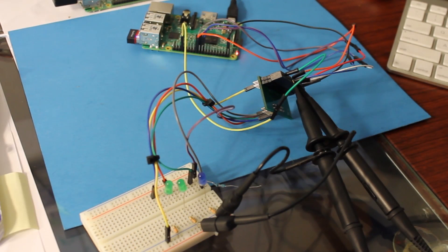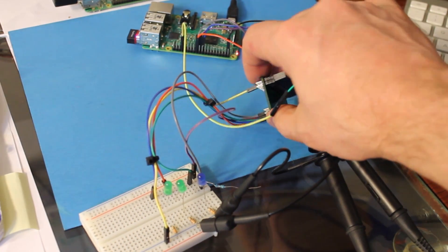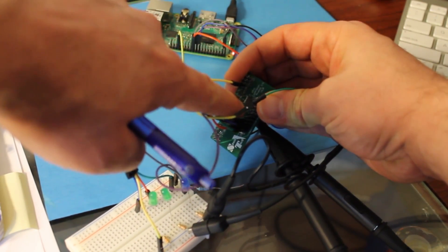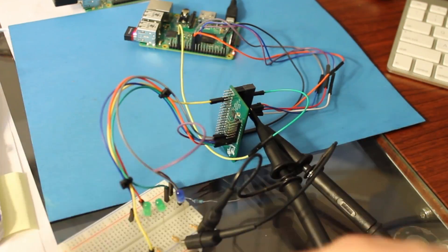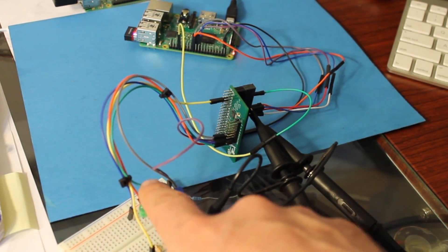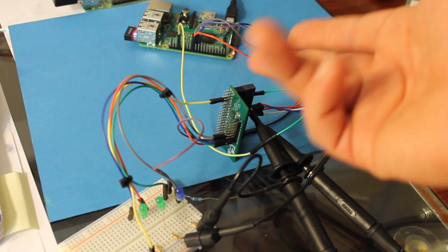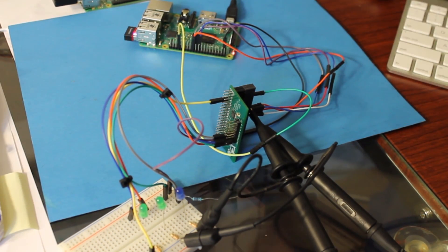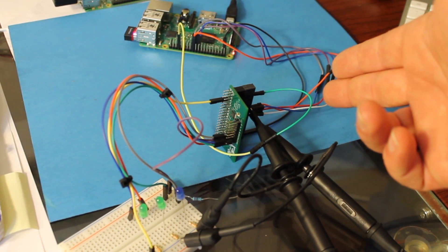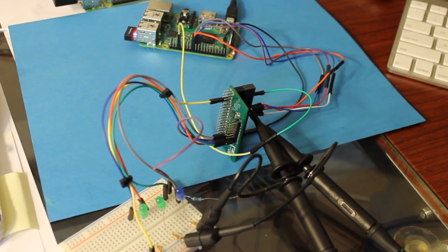Here is the rat's nest of the board with the SPI device — you can see a couple chips. I have some wires going to jumper fixes, some LEDs set up as a binary counter, my scope connected, and some long jumper wires going to the Raspberry Pi. Remember, we're going to be sending 15 MHz over these wires, so the signal is not going to look that great. You'll see that in a second.